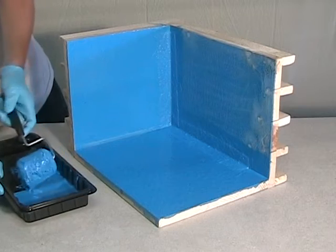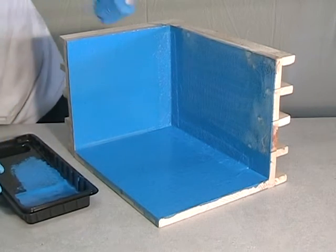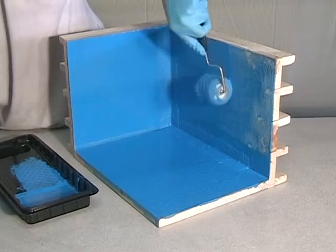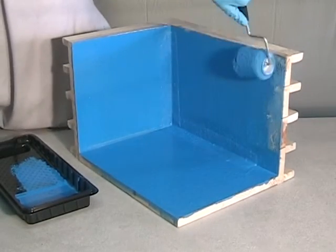Hardwoods have a much tighter grain pattern and do not move around as much when something moist like a coating is applied to them. This is why you may find yourself applying anywhere from 2 to maybe 3 or 4 thin coats to arrive at a good smooth finish.